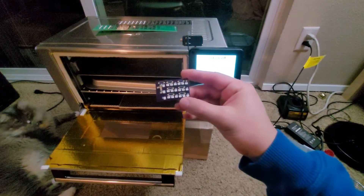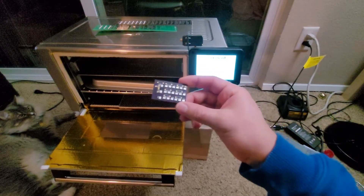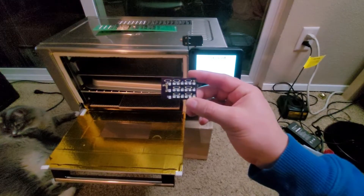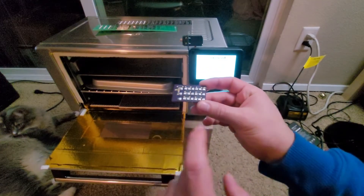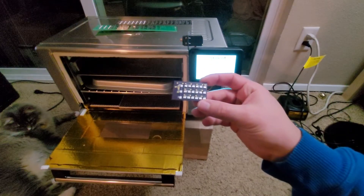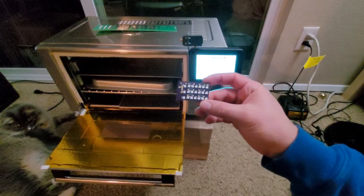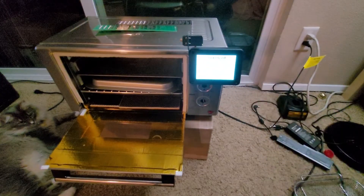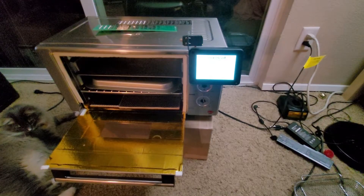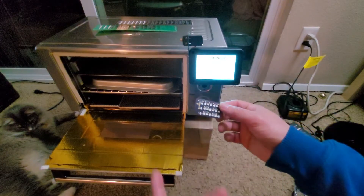This is the board I tested with. This is just one of the old test boards we had when we were building our LED taillights for one of our cars. These came out pretty good. I even put just a tiny bit of solder on one of these and it still made a really good connection. All the LEDs on here work and I tested it. I'm really happy with the profile — that was just a stock no-lead profile, because that's non-lead solder. I think if I got the correct profile, that would probably work even better, but regardless it didn't burn anything.